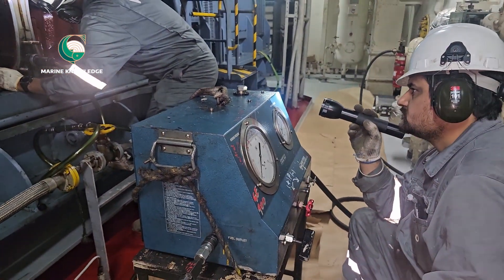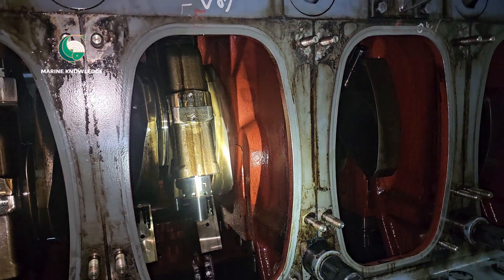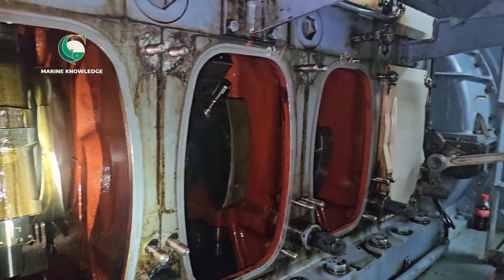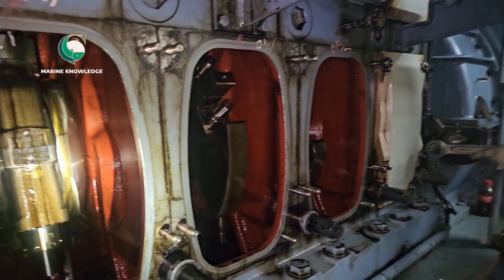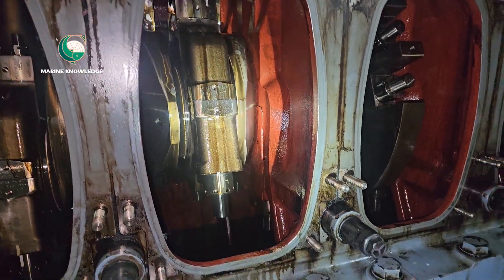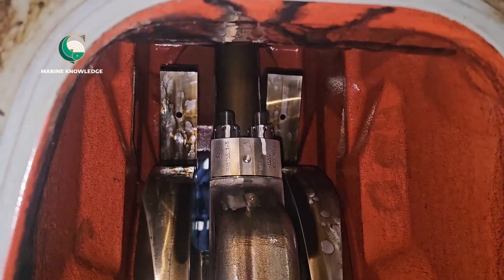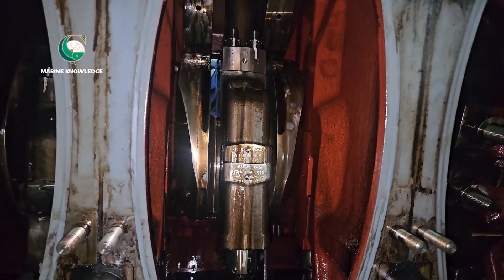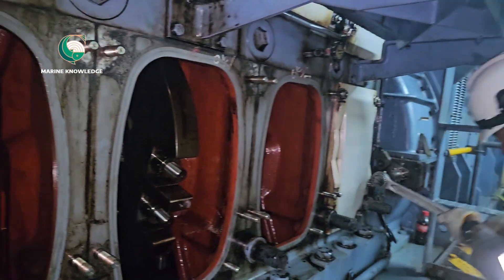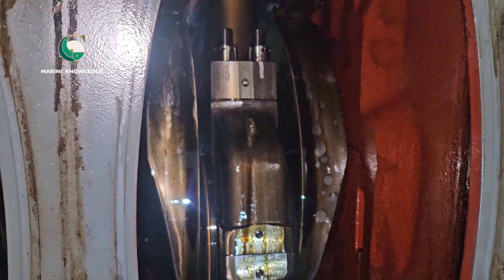After completion of our decarb, we put a marking on all the bolts. After 100 hours or 250 hours — whichever interval is mentioned by the maker — we do a visual check to see whether the markings are still in place. This is the first check to confirm that the bolts and nuts have not loosened. Here we do the visual check now: all the markings are in their place, with no change in direction for the nut.